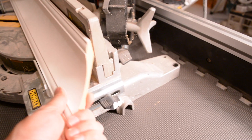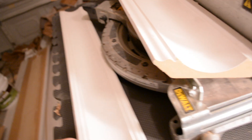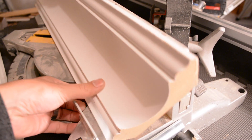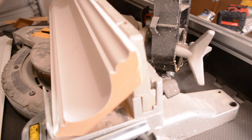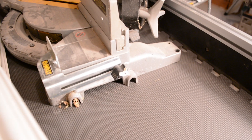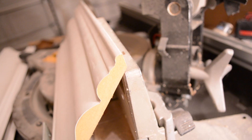The only reason I'm trying to modify it is because this big crown — his daddy — won't fit in here. It's the same profile, just way bigger. If I try to do that, it's maxed out — you can see it's not sitting flush, it's kind of tweaked up, which isn't good at all. That'll throw you off and it won't be installed correctly. And there's even bigger crowns — here's a seven and a quarter, and that's just not going to happen. It doesn't even allow it to sit flush on the fence.